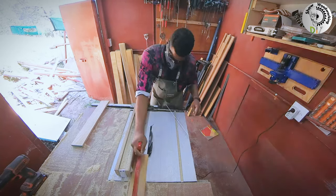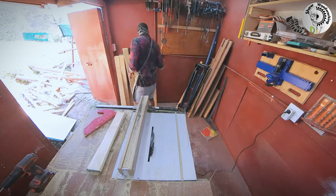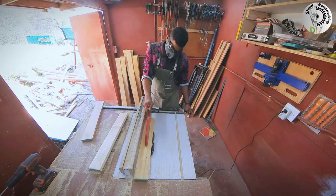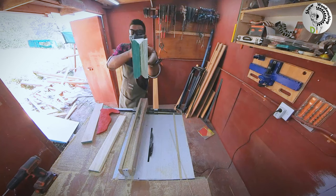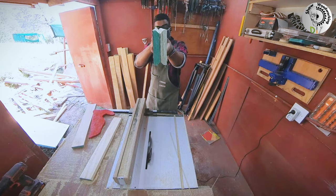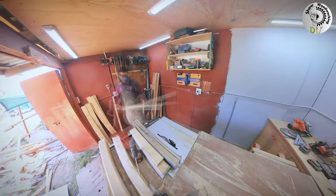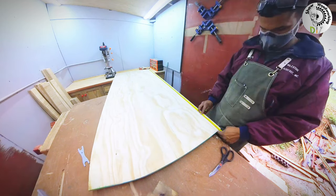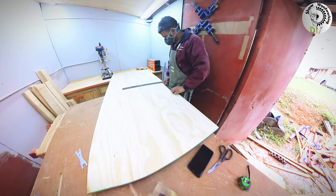In order to give your doors a 3D kind of effect, I would suggest putting a 45 degree chamfer as I did here. This will give your door more depth — you can see how much I cut off. Then I go ahead and cut 45 degree chamfers on all the other pieces. With that all done, we need to get our plywood panel and find our center point.